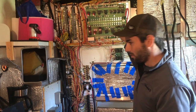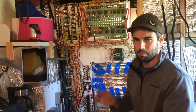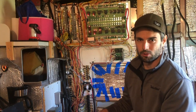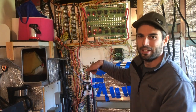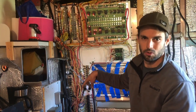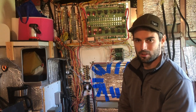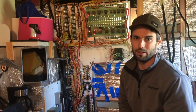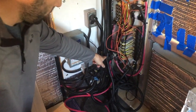Once we discovered the two sides of the board — that everything is really two halves — it made reconfiguring it easier. We were able to trace the different power sources for each half back into the cab of the truck, disconnect those, and bring in our house batteries to those junctions. Now everything is running off our house batteries, and when we plug in to shore power wherever we go, it charges those house batteries instead of the truck batteries — everything completely separate.